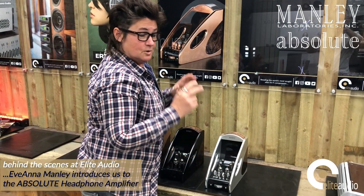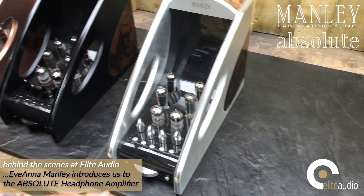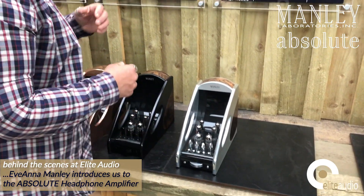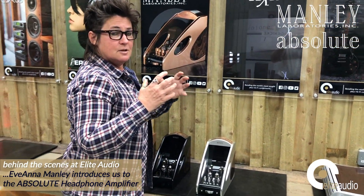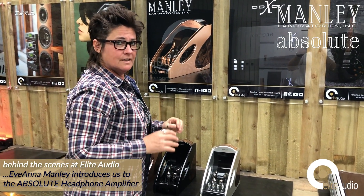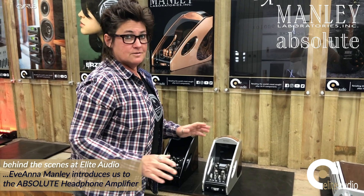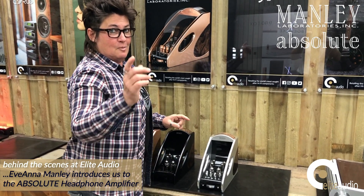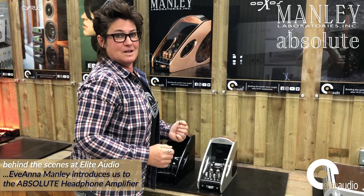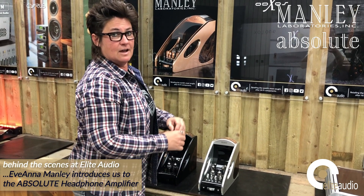You can also alter the amount of control with the negative feedback control here. We can go from no feedback up to ten dBs of global negative feedback applied to the circuit. This alters the slew rate of the amplifier — it changes the apparent speed. It's a little faster and punchier with less feedback but a little more raw sounding, and then you can tame it down by applying more feedback. There's no right or wrong — there's no headphone police going to say you're boosting the treble with very little feedback. The whole point is to let you custom tailor the sound to however you want it and wherever you find enjoyment in the music — that's what's important to us.